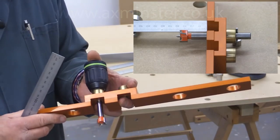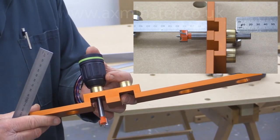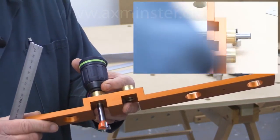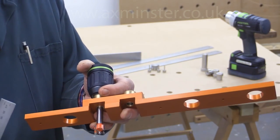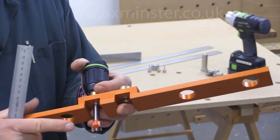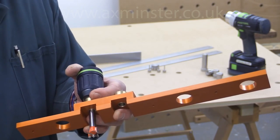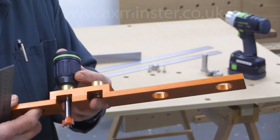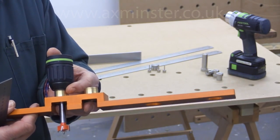In most cases, people would be using either 18mm — that's approximately three quarters of an inch — or maybe even 1 inch material to cut through. I think it would be unusual to go a lot deeper. But if you're making a purpose bench top and you want to go all the way through, if it's just so you can secure the underside of a parf dog, you could finish off the hole with an 8mm brad point cutter, because that's all you need to get that bolt through. But if you want to go all the way through regardless, drill as deep as you can with this and then very carefully finish the rest of the way off by hand.